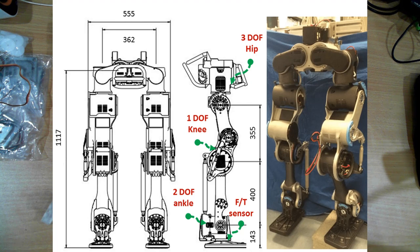The downside of direct drive is that all the mass for your drive system — gearbox and motor — is at that joint. If that joint is part of a limb, like the ankle of your robot, when you move your leg forward you have to accelerate that mass and then decelerate it. This increases the torque needed at the higher joints to get speed. The heavier the end is, the more torque you need to accelerate it. If you can move that mass closer to the top joint, you reduce the torque needed to accelerate the leg.